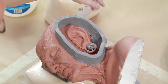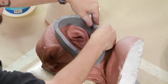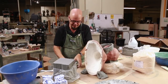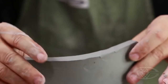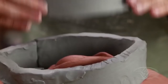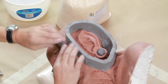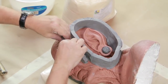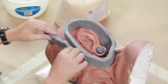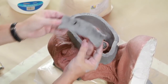When you're working mold walls like this, try not to get in there with your fingers and make all kinds of fingerprinty stuff. Try to just use your clay as a wall - you stick it, you leave it alone. Butt the next one up, maybe smush a little bit together, but try to work cleanly. If that's your wall and you stick it there, you're done - don't get in there. I see all kinds of beginning mold makers get in there trying to make it all perfect, and they end up with a horrible lumpy mess.